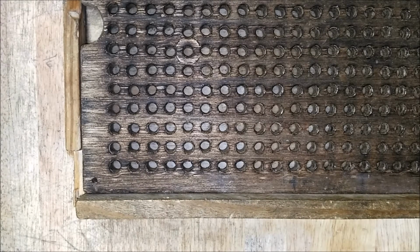Really, like I said, I changed how I warm the dies. I quit really warming them as much. It's maybe 60 degrees here instead of 40, 50. Dies are just a little cool to the touch instead of cold. I think that made a difference. And a decent amount of lube when you're seating the cores, and as minimal as possible when you're forming the points. And getting the speed and steadiness during point forming, I can't stress that one enough. That makes as much difference, if not more. A little too fast or a little too slow screws things up. When you get going and you get it right, you just keep at it, and the longer you keep at it, the more stable you can stay.